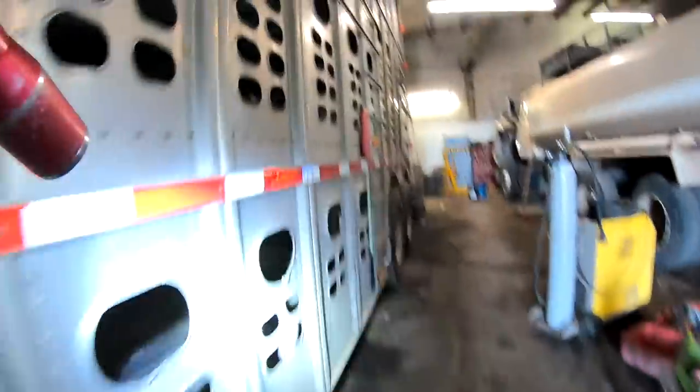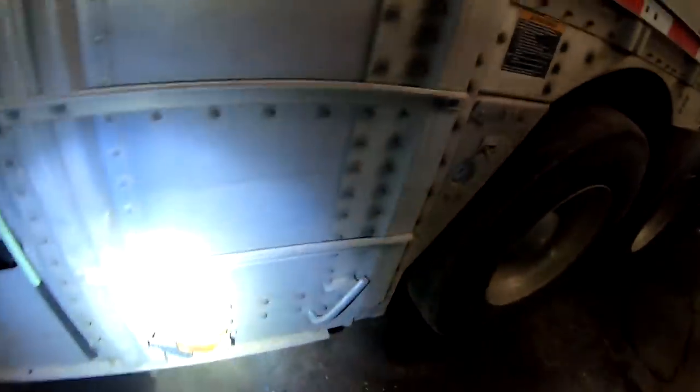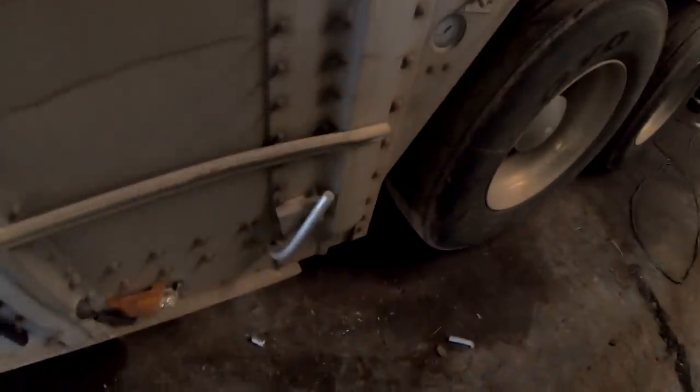There's a drain in here, and they hit something. You can see the damage to the light. They're going to change that light, but they broke this rod off, so I bent it and welded another rod on there. The owner was in town, and he didn't really know what size rod to get. He got 3/4, and it's actually 5/8, so we kind of scabbed a chunk on there and welded it, and it fits through the hole in the body, so it works.